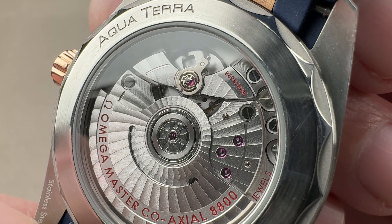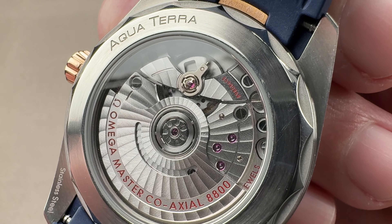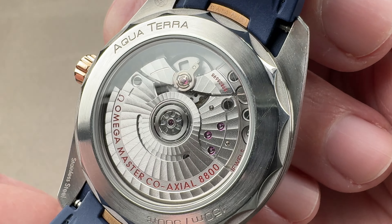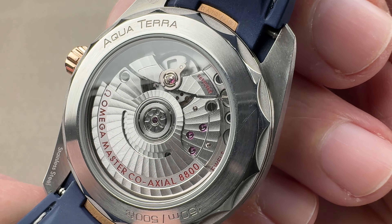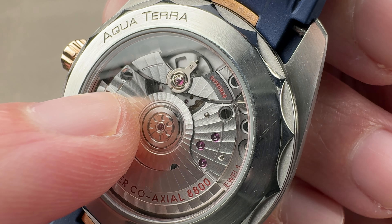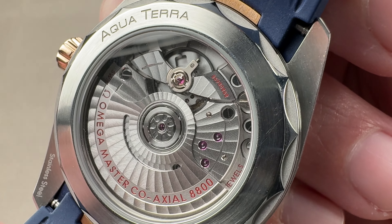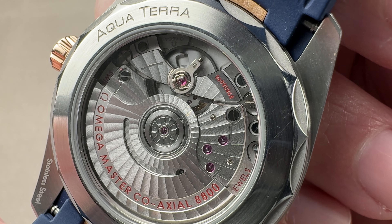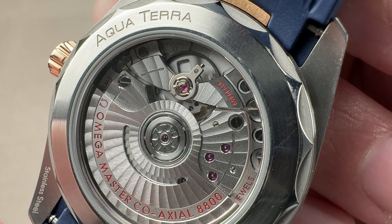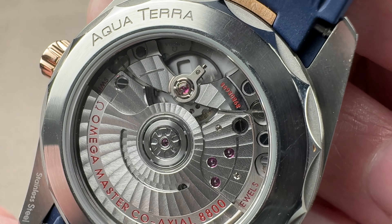All this pivots on 35 jewels and it has the Daniels tri-level co-axial escapement — the latest version developed by Omega of George Daniels' double impulse direct and indirect impulse tangential friction escapement. He created the original in 1974, sold it to Omega, and it was industrialized and serialized for the first time on Omegas in 1999. From the late 2000s forward, the tri-level co-axial has one plane for transmission of energy from the drive train and two planes for pulsing the roller table and lever, working as both a direct and indirect impulse system — a little like a Swiss lever, a little like a chronometer-style detent escapement. The result is tangential friction at the impulse rather than sliding friction, which lowers friction, increases power reserve, improves chronometry, and reduces maintenance requirements.